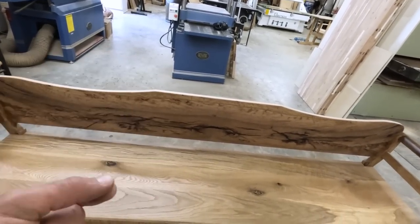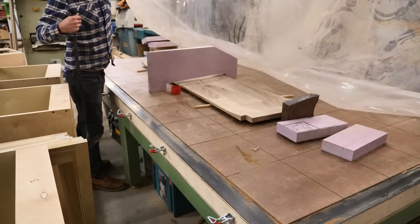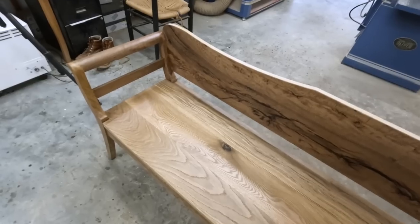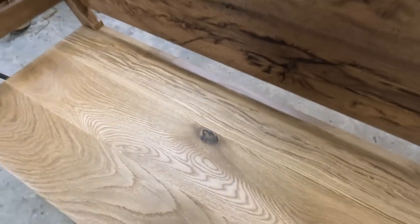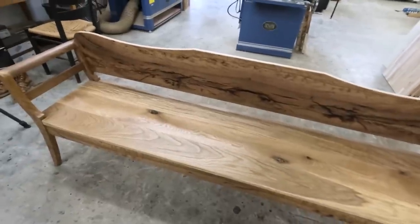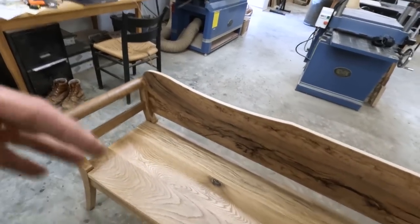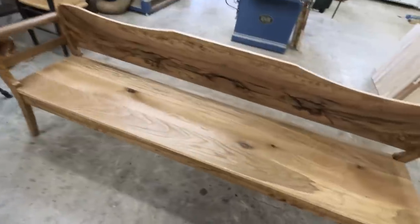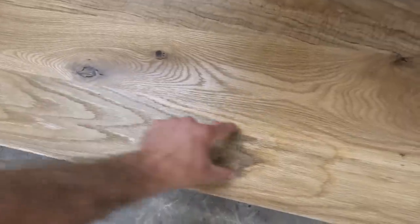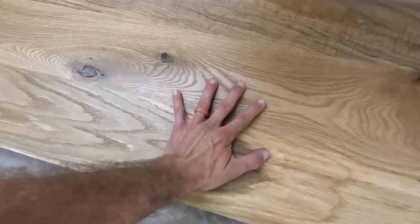For the finish, we ended up fuming this with ammonia. This is a process where you capture the wood in an enclosed space and use high-strength ammonia. It reacts with the tannins in the oak and turns it this nice brown color. You can adjust how dark it goes by how long you expose it. This is something I haven't done in a while, but it did a good job of matching this white oak to the Live Oak. I got a lot of heat in the last video for putting regular white oak on the table extensions without matching the color, so on this one we blended it a little. There's more tannins in the heartwood so you get more reaction and a darker color. You can go darker if you want — just leave it overnight.